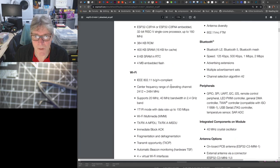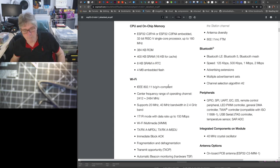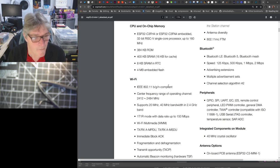But yeah, being able to run the MicroPython on it's useful. But it's really for comms more than anything else. So it has a UART link to the STM32, and it has six pins to the FPGA. Those six pins can either be used as SPI plus UART, or it can be used as QSPI.